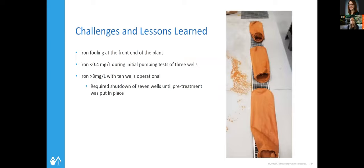One big lesson learned, especially when utilizing different resins, is that they can be fairly sensitive to fouling. This was early on in the process — we weren't as familiar with it back in 2015. Piloting is important for figuring out these things. Pretreatment was implemented to mitigate the iron fouling we were seeing initially on site, and you can see that here in these orange filter bags.